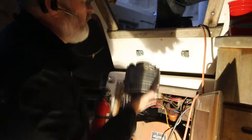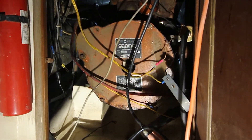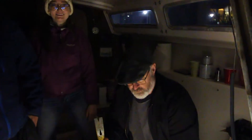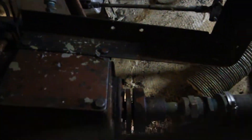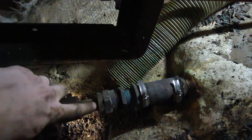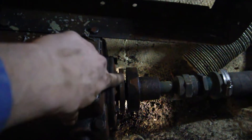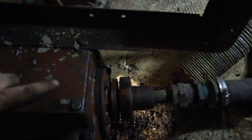First part of the engine is off. There's likely to be gas in that. What we're doing is we are lifting the front of the motor and pulling it back a little bit to break the seal with the shaft. Here we have the drive shaft coming through the hull with the stuffing box, which usually has rope in it, and this is where we are trying to separate these two ends.